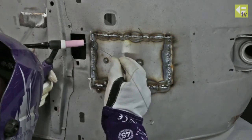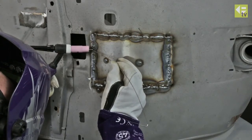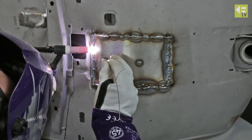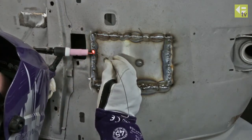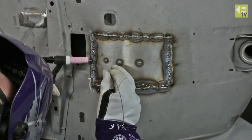I'm just working up and down the joint to spread the heat — touching the tungsten down, starting with the trigger, then lifting up to draw out the arc, releasing the trigger to allow the post gas to run out, and then moving on to the next section.